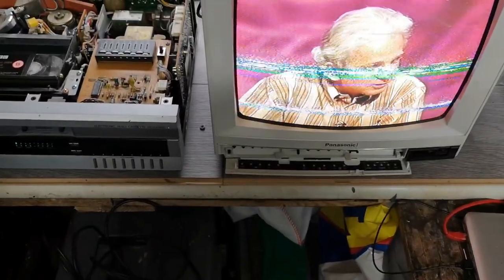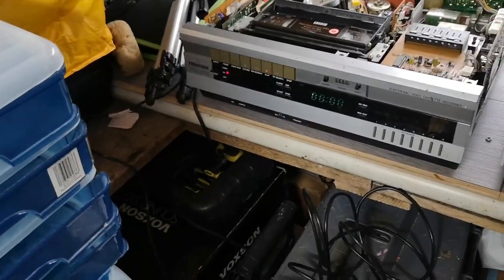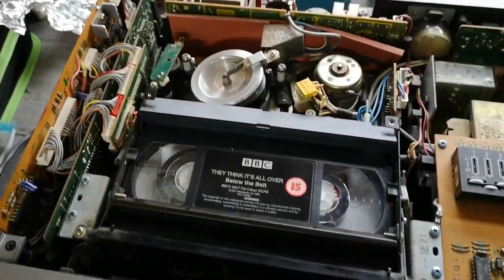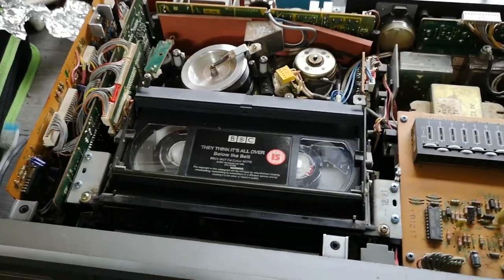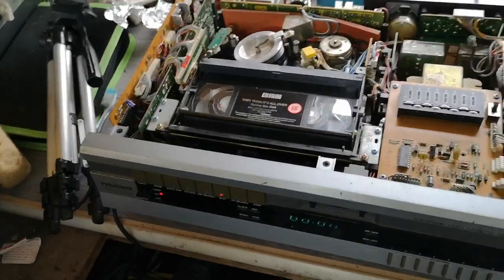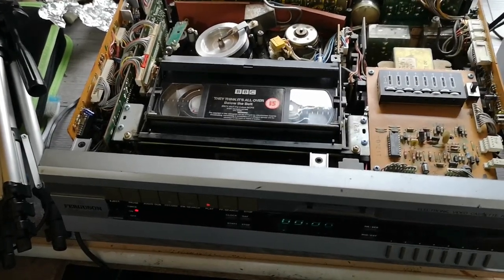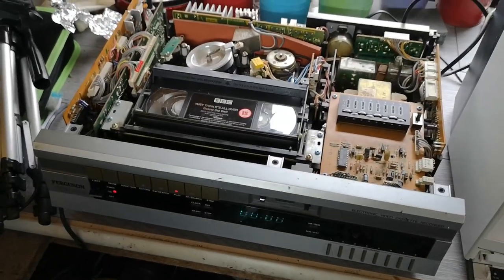Quick update — it's still rolling, albeit slower, but the picture has been restored. There's no warbling on the audio, but I wonder if it needs further setup beyond just the tape posts and position of the audio control head. There might be a slight fluctuation in capstan speed. Ultimately it's going to take a bit more troubleshooting, but the main core deck functions do seem to be working and it at least plays back a picture, so it's not urgent. Thanks again for watching — take care and don't forget to subscribe.